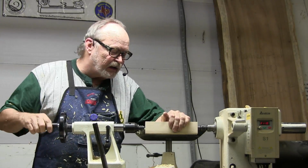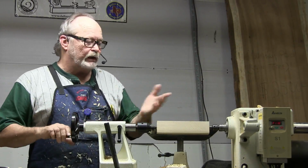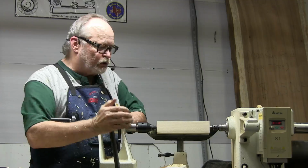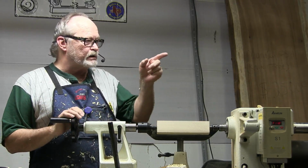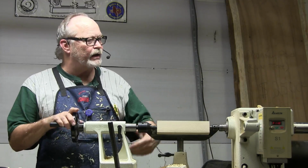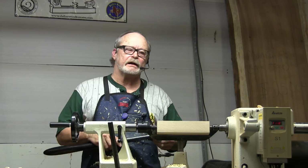Well, a lot of the cuts are finishing cuts. A hundred years ago, this was sandpaper and long grain turning. Even if you'd done everything with a gouge, you'd come back and clean up and finish off with a skew. And you should be able to get a finish like that pretty easily. It was chippy because there's kind of a knot or an old branch in that, so I had to hit it again one more time. But you can even turn a knot. You can turn a knot where there's zero chip out using that technique.